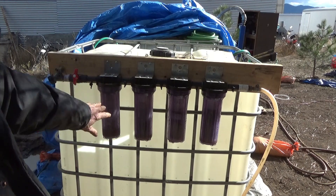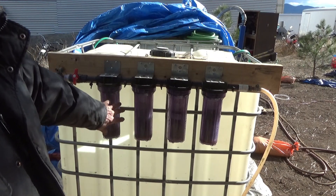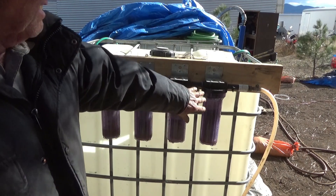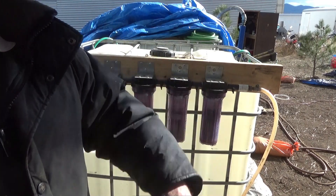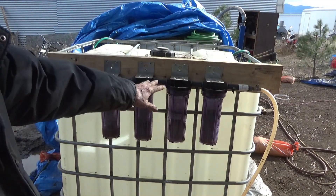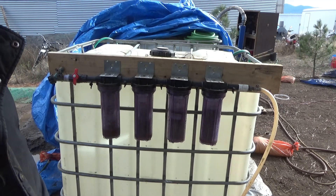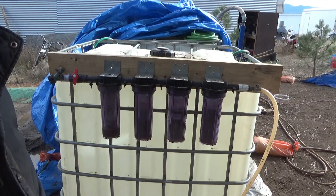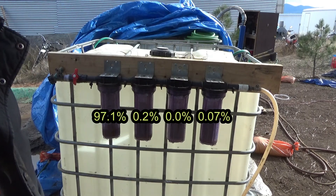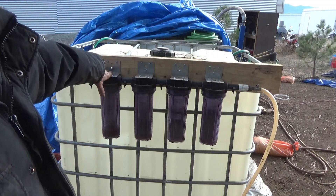The original plan was I was hoping to get at least 50% extraction from the solution flowing through each stage — so there'd be 50%, 75%, 87.5%, and over 90% extraction by the time you went through all four stages. But once I took the samples, here's what we actually turned up in terms of extraction of the total gold being input into the system — a lot better than I expected. Basically stage one was getting 97% of the gold.